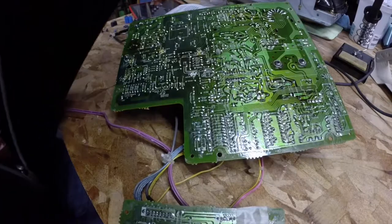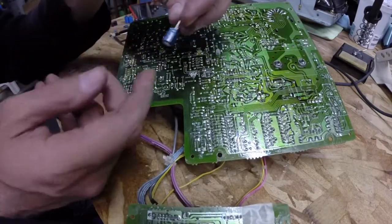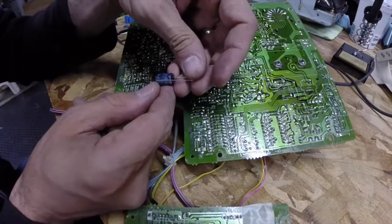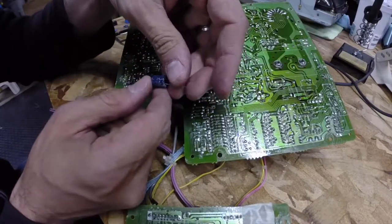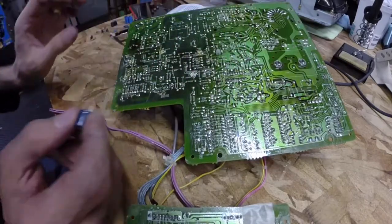Sometimes you may have to go back in and knock a little tiny bit more solder off, but generally that's about all it takes. Now the part's loose, and there's probably just a wee bit of solder left on the side of the leg. You can come back in, heat that up just a little bit more and it'll pop right out. Take that, throw it into your out bucket. Here's our new part for that position — a 25 volt, 330 microfarad capacitor.